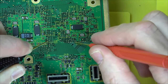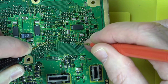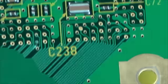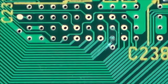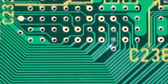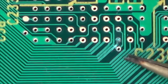This is an honest fault — it hasn't gone through 10 repair shops. Look, there's no continuity here, but when I go underneath elsewhere I do have continuity. Let's give that a good cleanup — I think that's going to be the only fault. It's weird how water just sat on that one little spot. I'll have a look around elsewhere, but I just think that's going to be it. Let's get some IPA on it and clean it up. Hopefully the via itself will be intact, otherwise that's going to need a BGA rework.